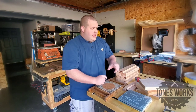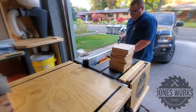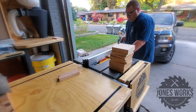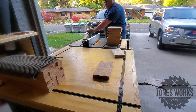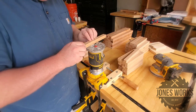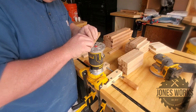I've already cut the long pieces and now we're gonna move on to cutting the short pieces. There are actually two different sizes we need to cut — two thicker ones that will be the same thickness as the long pieces. These two short pieces and the long pieces will surround the tile, and then there are two smaller thinner pieces on the outside that are for the handles. It'll be impossible to get a router in to make the round-over after the glue-up, so before that we're gonna put our router in a vise and make that round-over before the glue-up.